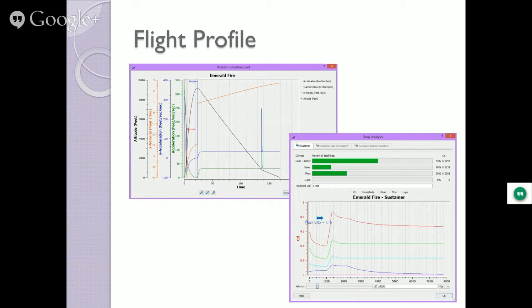In this particular graph, there's a parameter in the drag equation known as the drag coefficient, CD. It's a unitless number, and the bigger it is, the more drag there is, no matter what the shape of the thing is. So you get a CD of 0.75, then if you have a nose cone or a square or whatever, the surface area is multiplied by that in the equation. But that CD has to do with the characteristics of the shape, and the CD tends to stay the same. So if you design a rocket and you know what the CD is, you know what the drag force is going to be on it, you know what types of velocity curves you're going to experience.